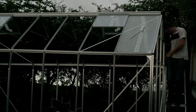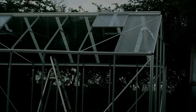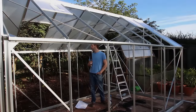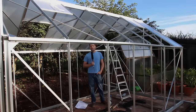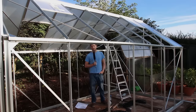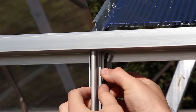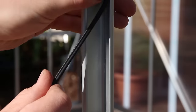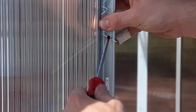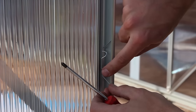I started some glazing on the second evening but the day was drawing to a close, so I decided to finish up and start again the following day. It's day three of building the greenhouse - glazing day. It's a little bit windy today but so far it's not been a problem. We start by sticking a rubber sealing strip on either side of the glazing panel. There's a channel on the rubber strip and a ridge on the frame - you just run your finger down and it pops on. Then you put the panel in place and use glazing clips to hold them down. I strongly recommend using a screwdriver rather than your finger to force the clips into place as it will hurt.